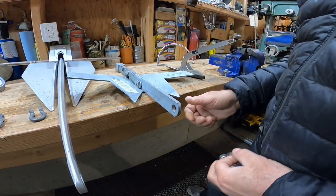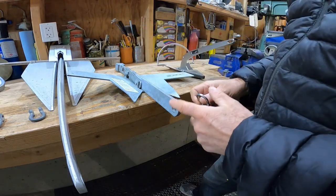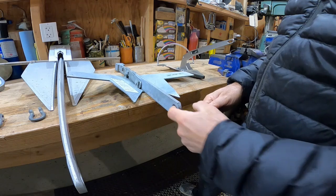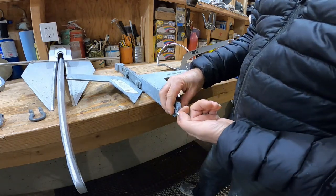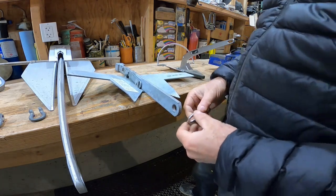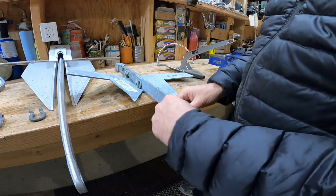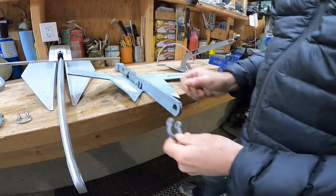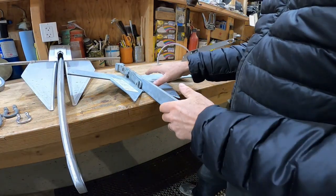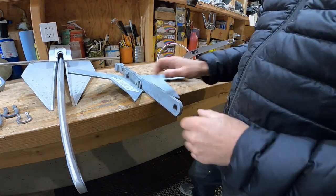Here's the 5-kilogram flying fluke anchor. These anchors are designed to be tossed in the water and sort of glide out away from you. When used like that, they don't even want you to use any chain because that just drags it down. You can tie a rope directly or pass a shackle in this fashion for a smooth attachment. But if you want to use the anchor conventionally, you could use chain — in that case, a quarter-inch shackle will pass. A 5/16ths shackle will not pass. This is kind of a specialty anchor; they got the hole correct for its intended use.